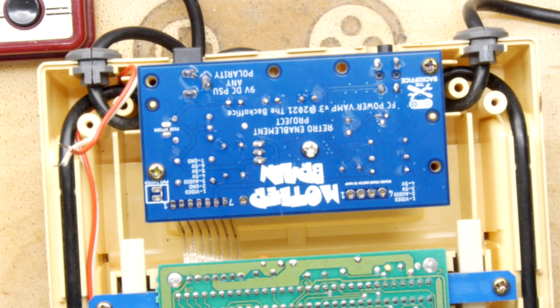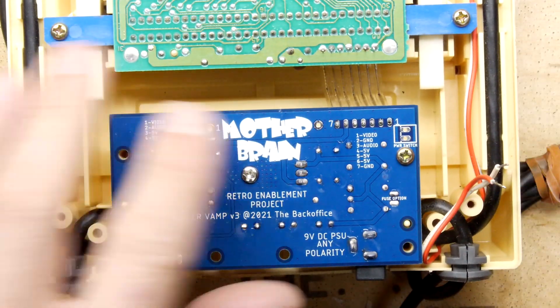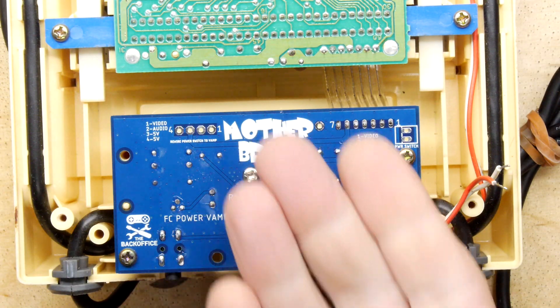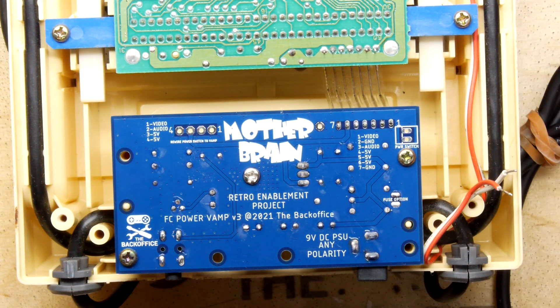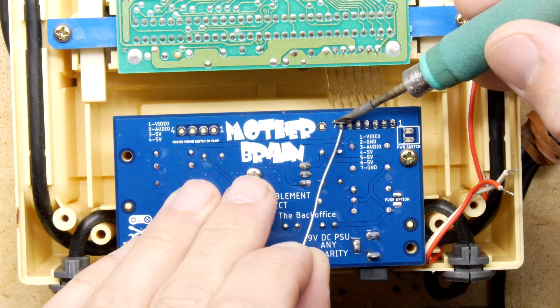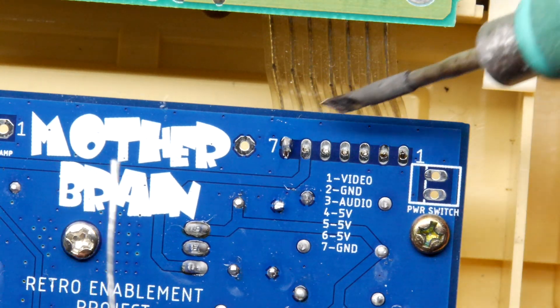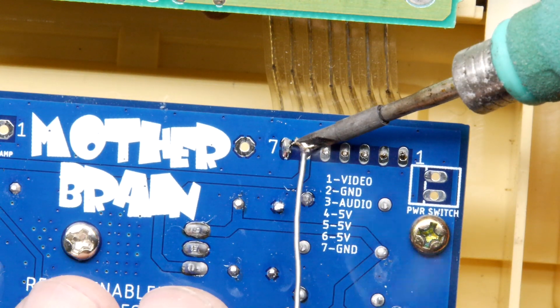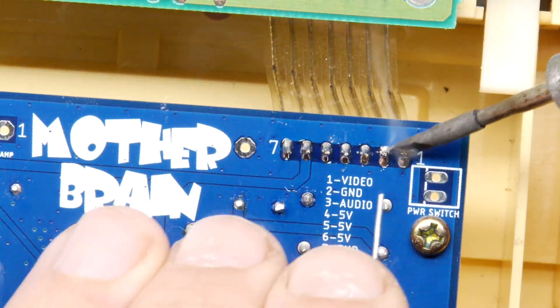All of that's on the website though. Don't worry. Just have a look at the website and look at the installation pictures. You can't go wrong. It's nice and simple. So I'm going to flip this over. This is the way I always work on them, because you can read the writing properly. And then I've got my soldering iron — it's set to 350, so it's just a more reasonable temperature now. It's up to temperature and just hold your soldering iron against the pin and apply a bit of solder from the other side until you see it drift in.